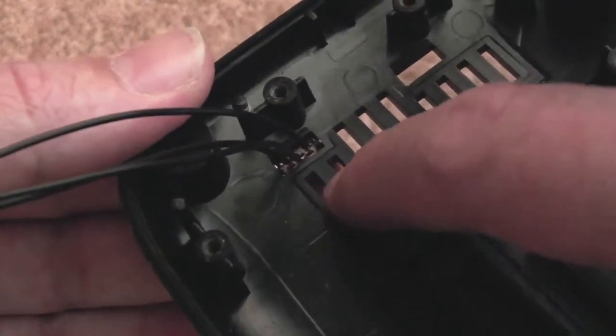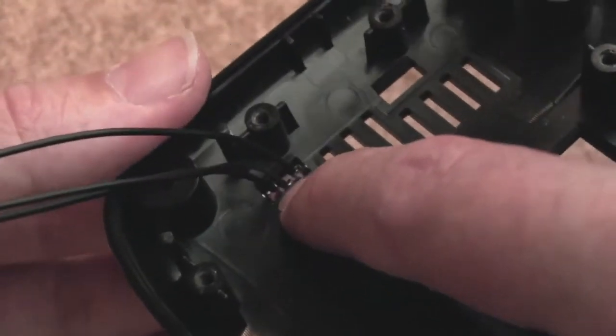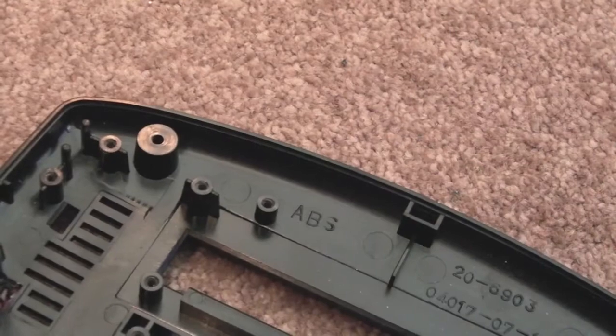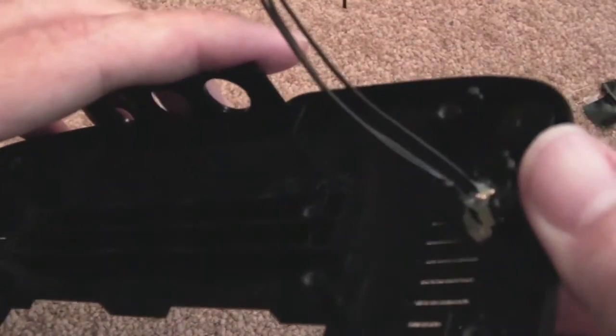As you can see I've got the switch in place. I've soldered on the three wires, bent the middle tab away from the other two and the two the opposite direction so they're all spaced apart and won't short out. Tested to make sure I've got continuity when switching into each of the two positions. Now I'll just get the hot glue and put a blob around that area. I'll put a little bit of tape over the vent first, then peel it back after gluing. Just a small amount into the cavity and around the surrounding area - that'll hold it from the inside.